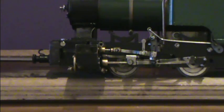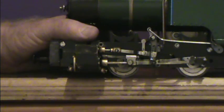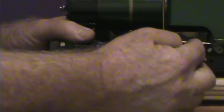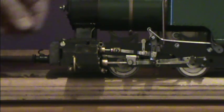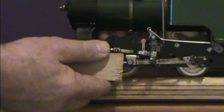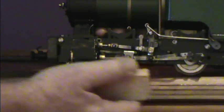The first thing I did was to identify when the rear axle, or crank, was in a back dead centre position. That's as far as the pin will go when the wheel's turning backwards before it starts to move forward again to finish its rotation, and that correlates to the piston being at its furthest back position. To do that, I pushed the crank as far back as possible with the wheels off the ground. I pushed as hard as I could on the crank pin, or the conrod, not to the point of bending the engine in half, to get this crank pin as far back as possible, which is the dead centre position.